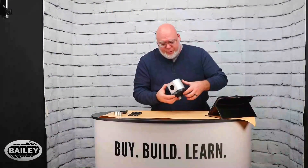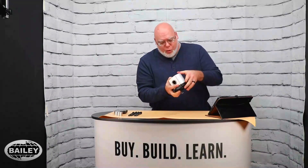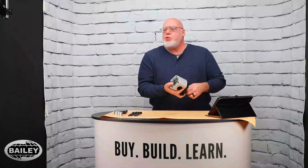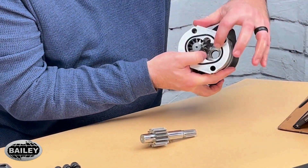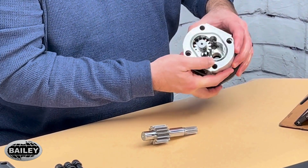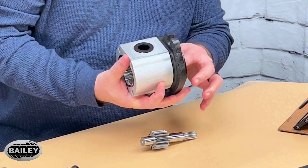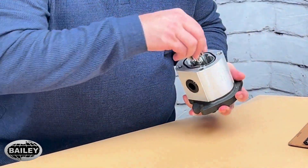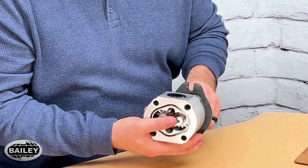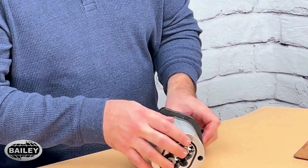As far as maintenance of these guys, they're pretty simple to deal with. We're talking about some precision gearing, so we want to keep trash out of there. We do that by having a suction strainer on one end and a filter on the other end to keep your oil clean. Bad, dirty oil wears these gears out. You have some seals in this pump — you need to make sure your seals are good. If you get some leakage around the shaft, there's a shaft seal you can replace, and there's a back seal you can replace in order to have your pump last a little bit longer. You don't have to replace the pump — you can just replace the seals, and then you can go for another 5, 10, 20 years on these things.